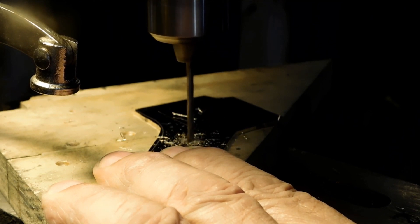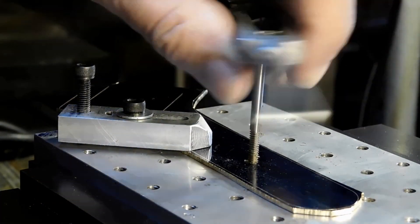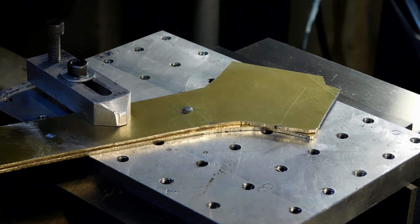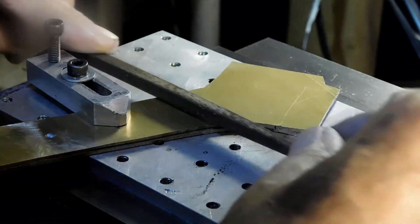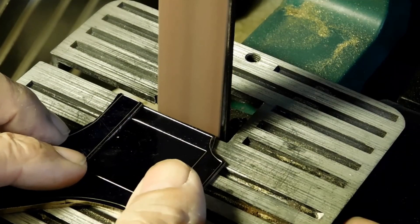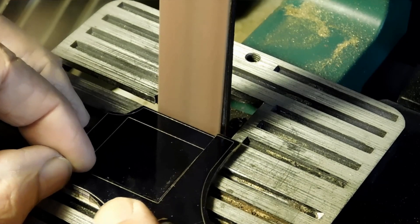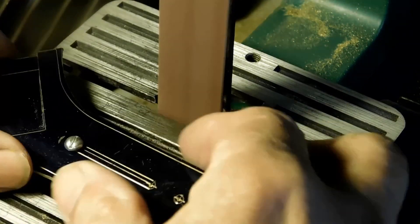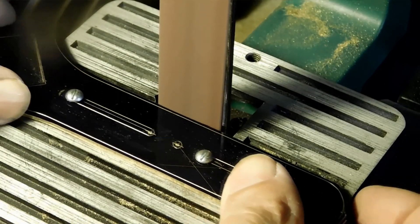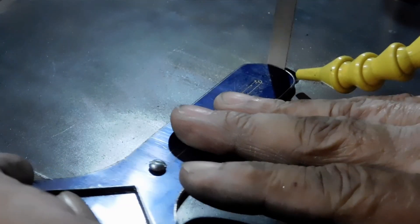No lift — that's good. Just shine it up a little bit on the backside. Now we're going to hold these two pieces together, so I'm tapping this side and I put two screws in so the two pieces are held together. I've got a file and I'm just going to take off the back side of these screws to make them flush with the brass. Here's the belt sander — I take it down to the line as best I can, close to the line at least. Now over at the die filer — this is where I'll actually take the line away.